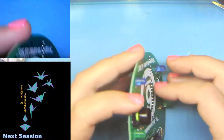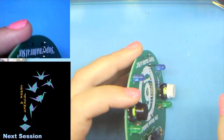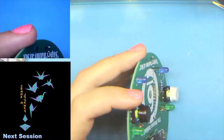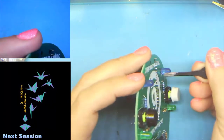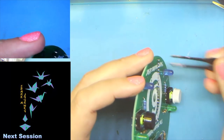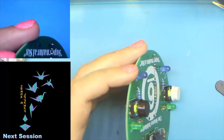This is a toy to sit on your desk at work and say, here, see what I made. It's not going to Mars. So I'm going to call all of these acceptable, technically. If this was going to Mars, this one here has a little too little solder. Yeah, that one there has a bit much. But for this kind of job, we're okay.